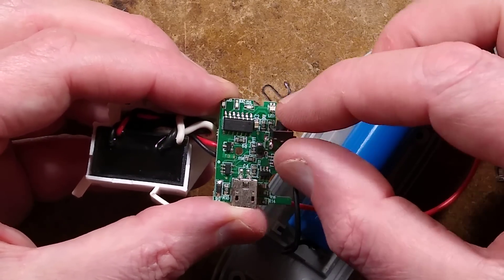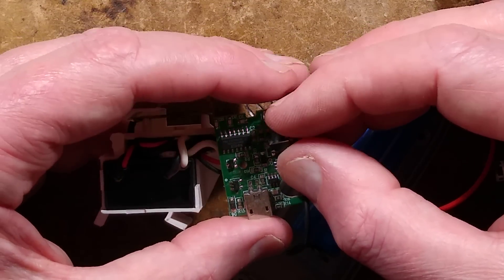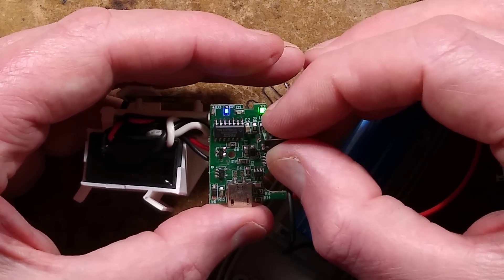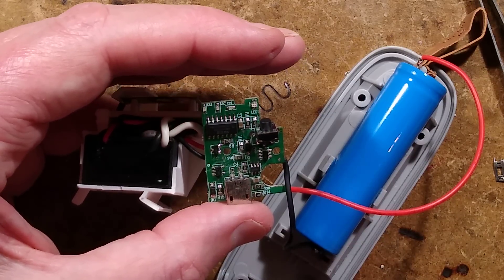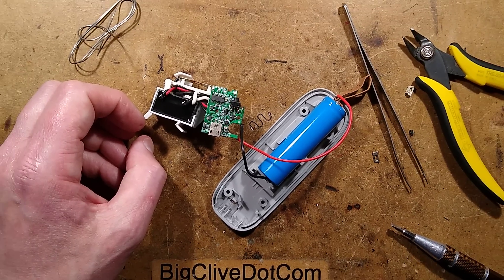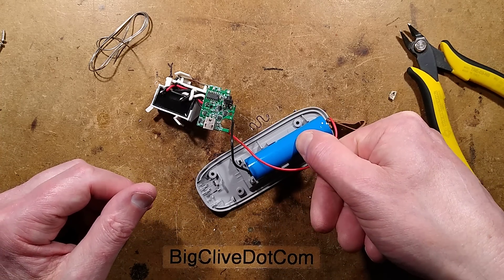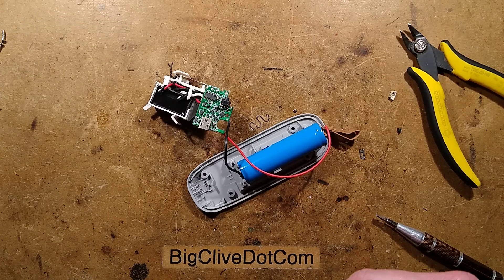I've solved the issue by soldering a little button on — it's not the correct size for the housing but it'll do. If I shield it so you can see the LEDs, when I press and hold it should power up and go into a mode. Click it and it goes through the modes. Press and hold and it strobes them, then goes out again. As long as it doesn't wake up on its own again, that is it fixed. The switch was faulty — I measured resistance across it and the fault cleared when I removed it.